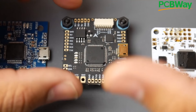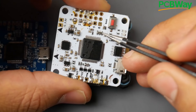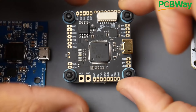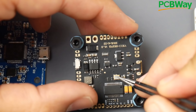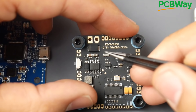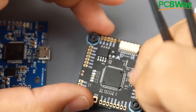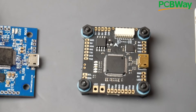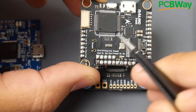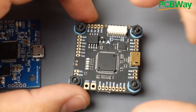Next, you want something called a resonator. If you pick up any F4 flight controller you'll see this little piece — it doesn't have a hole. There's another one that looks similar with a hole, but that would be a barometer. This is the 8 MHz resonator. Some boards have it on the front, some on the back. Don't confuse it with a 27 MHz crystal, which is for the OSD — a more advanced topic. Even F7 flight controllers have the resonator, and it's a must-have alongside the gyro.